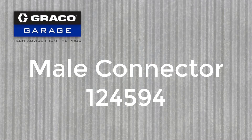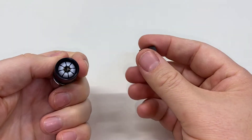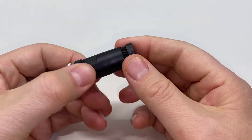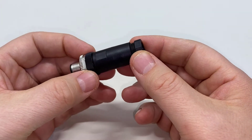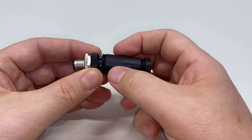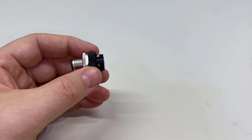The connectors actually thread apart in a couple of different places. This is really just an inverted nut that compresses the cable gland, so you don't need to take that off — leave it a little bit loose so you can push your wire through. You're going to unthread closer to the base, and this barrel piece can just be set aside for the moment.